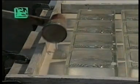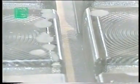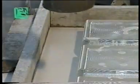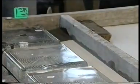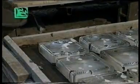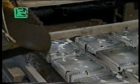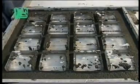Quick-drying liquid plaster is now poured in between the spaces and around the outside edge to ensure that the glass bricks remain fixed during prefabrication. When the plaster has solidified, proceed to the first concrete casting using R325 or R425 cement. The first layer must be extremely liquid, the next more consistent, and so on up to a thickness of 3 to 4 centimeters.